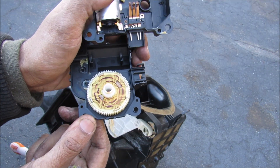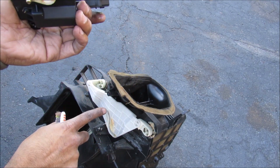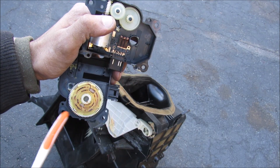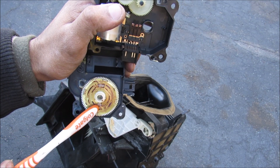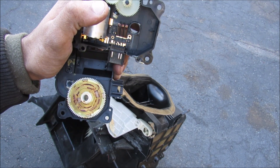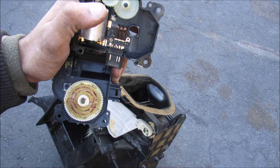Even this mechanism is quite complicated. The cam over here needs to know its timing — when to stop on this cam profile for the 4-bar mechanism. To do that there's this little built-in switch with these contacts here that contact this gear. There's actually a gap here on this side and on this side that correspond to these two contacts. When the gear reaches those gaps it'll open the circuit and stop the motor. In reverse, the same thing will happen to the other two contacts on this side and stop the motor.